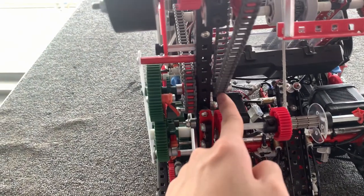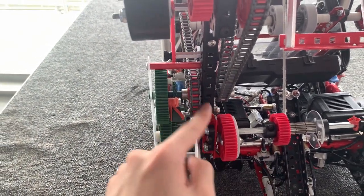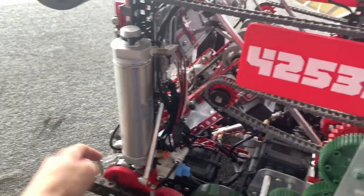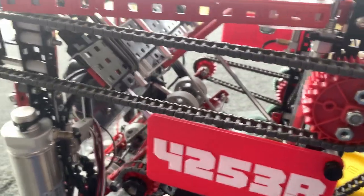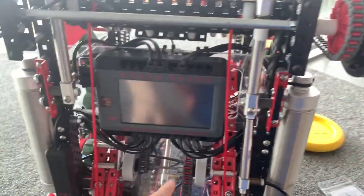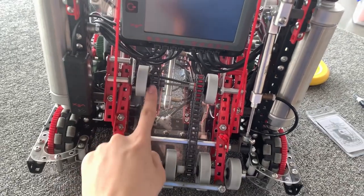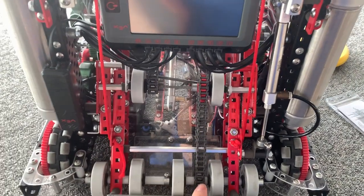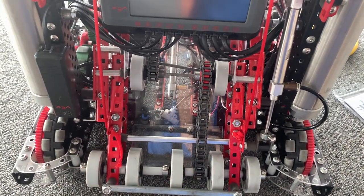Next, following the other chain, it will go from 360 RPM at 3 to 2 ratio to 540 RPM on the intake. I run three rollers. There's a 1-to-1 chain over here — a 1.65 inch wheel — so this is running at 540 RPM. And then lastly, with a 2-to-1 ratio, I'm running 1080 RPM on the bottom.